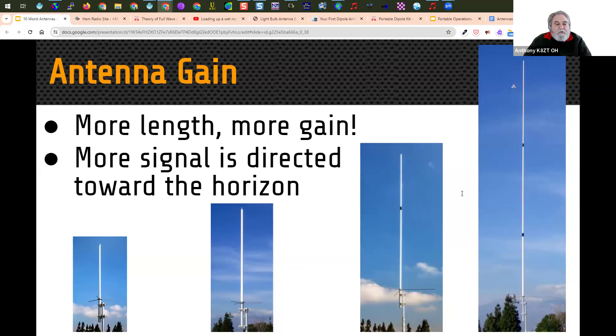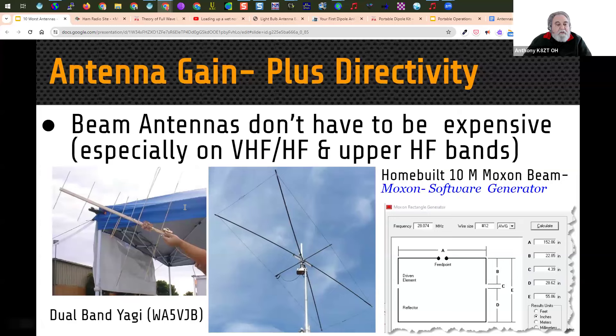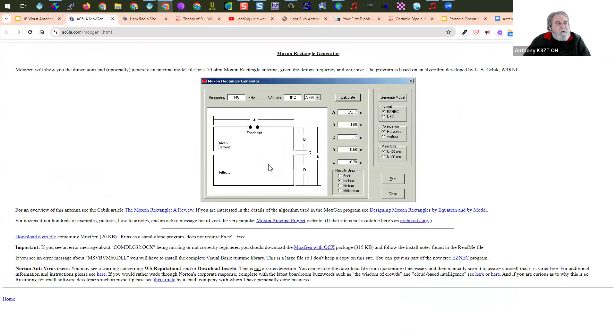The higher and longer you go, the more focused the radiation will be. You can also add gain by adding multiple elements such as a simple Yagi antenna — very easy to do at 20 meters and up in frequency, but when you start going down to 40, 80, and 160, they become difficult because of the size. There's a station near me, K3LR, who has a stacked tower array of three 40 meter beams — rather large, but very good. Another method instead of a Yagi is to build a Moxon antenna where the ends are folded back — I have a software calculator here to figure out the lengths if you want to build your own.